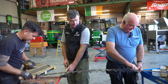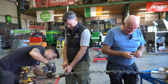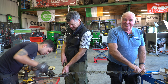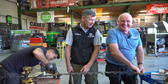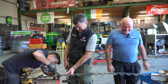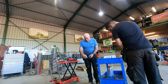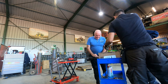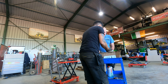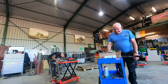We've taken the blade out of the combine and we're going to replace the sections on it. We're going to do it slightly differently — going back to the John Deere way: one up, one down. Because it keeps the fingers clean. Your blade this way cleans the finger — you have it on the bottom, and then one on the top, and one on the bottom alternating.